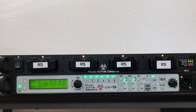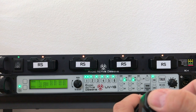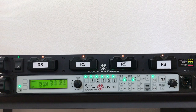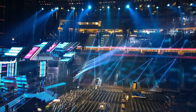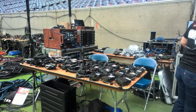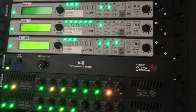Check party line channels 1 and 2 with the headset plugged into the belt pack. Walk the pack listening for transmit range from the base station with program music, or listen to clean audio until out of the transmit range. Key up and test the transmit from the pack.